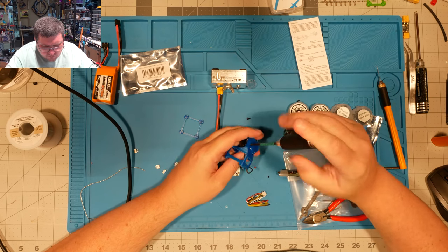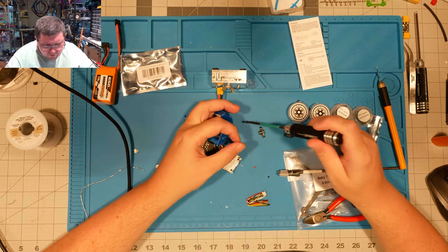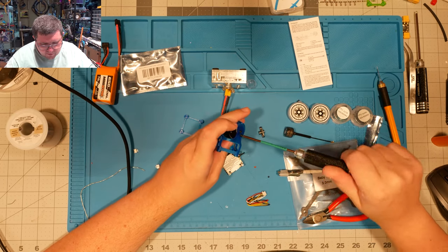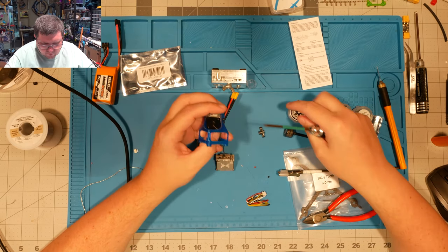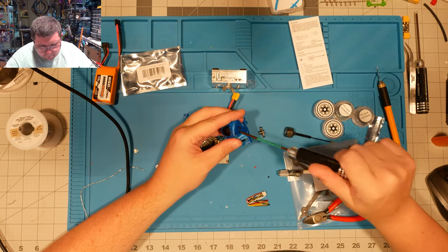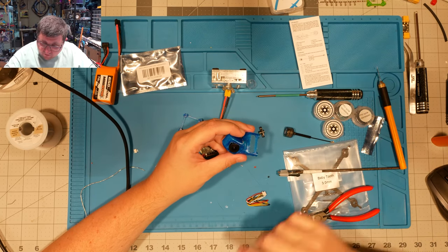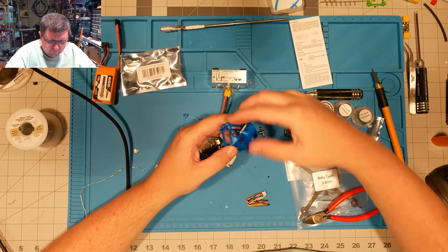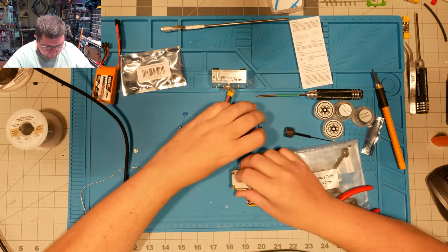Yeah, this canopy is called the Vista Pick canopy, and there's something called the Guitar Pick. You can probably find it if you Google Guitar Pick drone or Vista Pick drone. They invented this canopy and posted it to Thingiverse so that everyone could make Vista Picks with their stuff, and they use different frames. There's a number of options for frames. Just about any toothpick will really work, depending on what you're willing to accept in terms of weight. So if you wanted a 5 millimeter version of this guy, you could absolutely do up a 5 millimeter version of it and not have any ill effects from it, really.